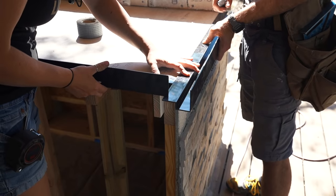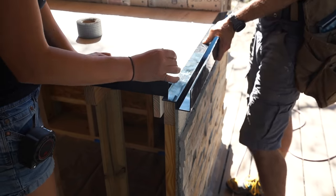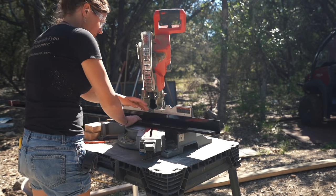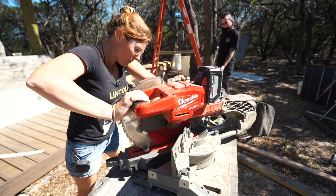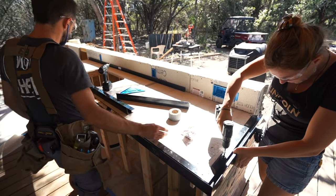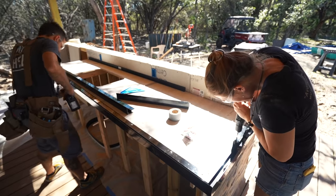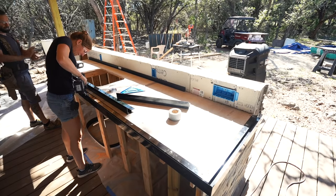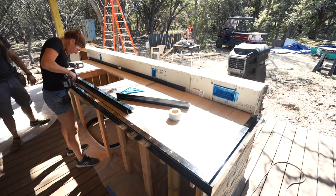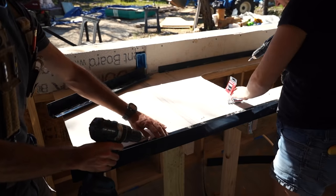To attach them, it's really straightforward and easy. You'll want to miter the corners at a 45. To get these to match perfectly, you can hold two pieces that have a square cut up to one another, then mark where the inside corners meet — this will save you from measuring and being slightly off. These runs come in eight-foot spans but are very easy to cut on a miter saw. I would cut both corner pieces before attaching. To attach, you can run in small screws, about five-eighths of an inch long. It is really easy to strip them because of the cement board they're going into, so just be easy when driving them in. If you have a long run, you just butt the next one right up to the previous one and repeat.